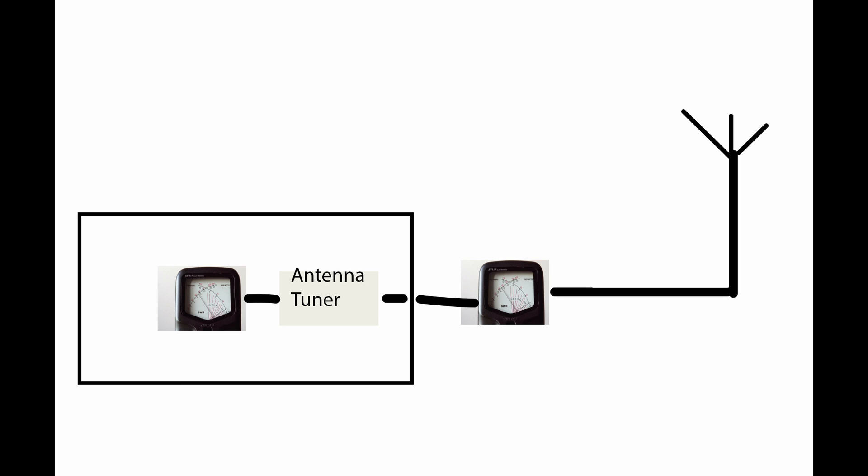In this diagram, on the left-hand side you've got a box representing your transceiver, and inside that transceiver is a VSWR meter. That feeds into an antenna tuner, and the output of that goes into another VSWR meter — your external VSWR meter — and then on to the antenna system. If that internal antenna tuner is switched off, then the VSWR meter inside your transceiver and your external VSWR meter should, in theory, indicate exactly the same values. The main advantage then is simply having that large external meter visible at all times without navigating a menu.